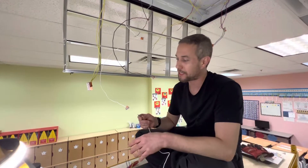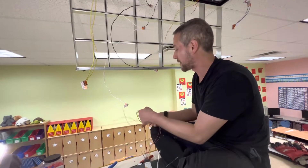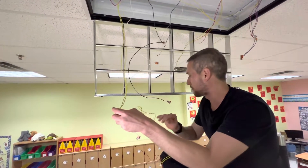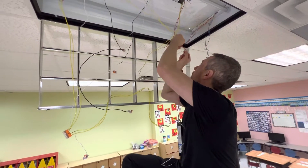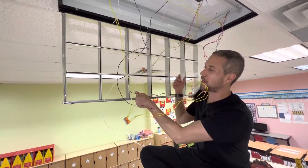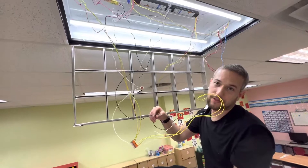It took some time to figure out, but what I do is bring the wires in here. It's not the safest method, and I don't recommend it exactly as-is. Instead of testing each one by one, I connect all of them — for example, all the yellows together and all the reds together — using Wago cable connectors. Then I put the neutral first, then the hot wire last. If it's working, the light comes on; if not, it doesn't.